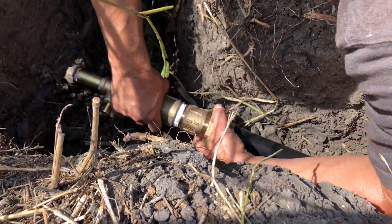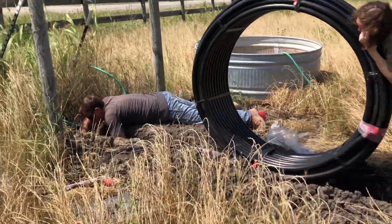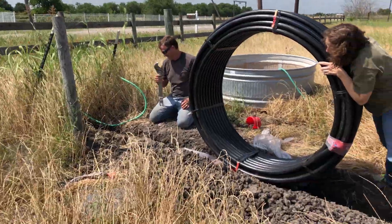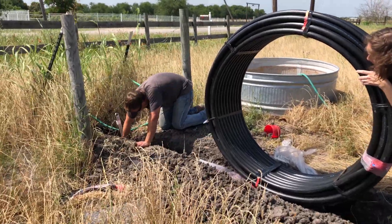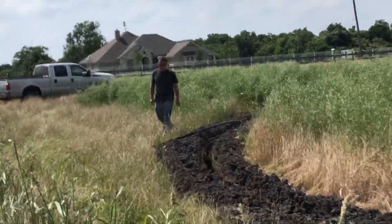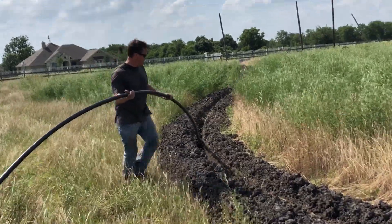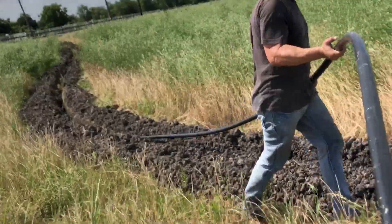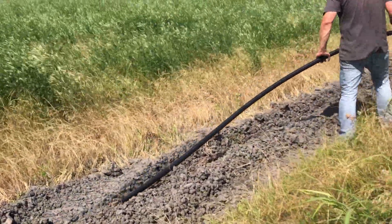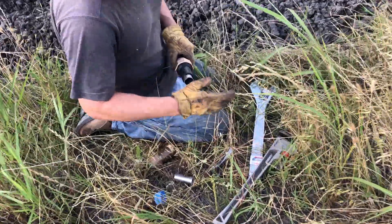The pipe is also generally called PE or poly pipe. You can't glue PE pipe — it either has to be fused by melting it together or joined with a mechanical connection. I got all the equipment at a company called ACT Pipe and Supply in Austin. They cater mostly to big developers and local utilities. I thought walking in they'd tell me to get lost, but everyone I talked to was extremely helpful — I couldn't have gotten the job done without their great customer service. I bought the pipe in 500-foot rolls to reduce the number of couplings, which is good since each coupling costs about $80.